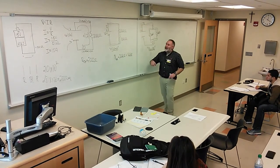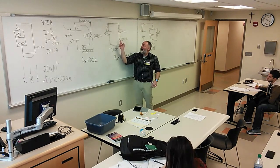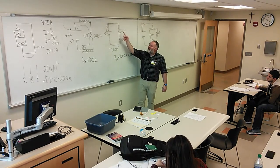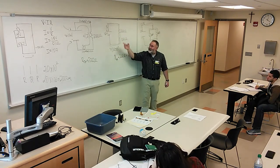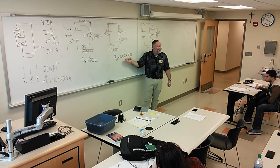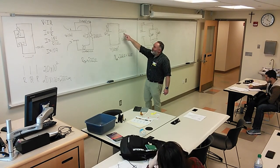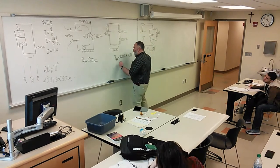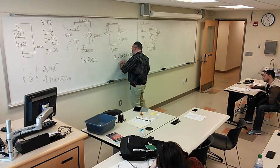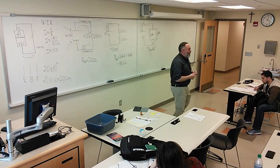Okay. Another word about straws and time and flow. In electronics, if you take resistors and you add them one after the other in series, their total resistance for the entire circuit just adds up. So if I take a 2,000 ohm resistor and add right behind it a 1,000 ohm resistor, my total resistance, wait for it, 3,000 ohms. Okay? You just add them up.